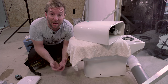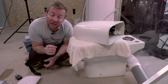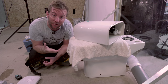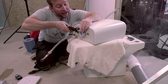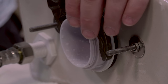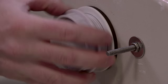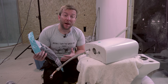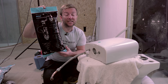So guys, we're pretty much halfway there — this is step three. We've done the really hard bit: taking the old cistern out, which can take some time. Be patient and make sure you've got plenty of towels about in case of any mini emergencies. All we need to do now is take out the old flush unit — very, very easy. The old flush units are generally held on by a big nut on the end, and you'll often need a large set of grips to undo that. Also at this point you might find a big metal clamp bracket on the bottom — don't worry, I'll explain that in a few minutes. Viva make lots of different types of flush for lots of different types of cistern, so make sure you get the right one. This is the Skylo universal flush valve.